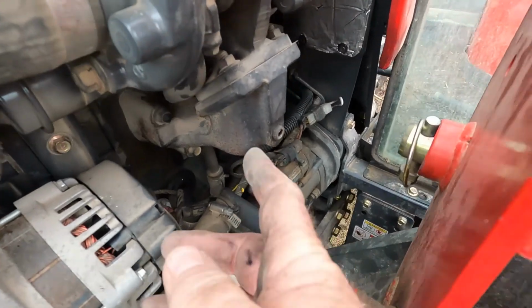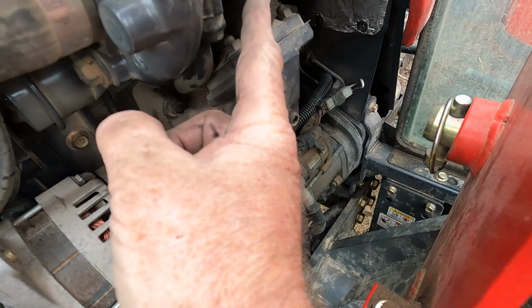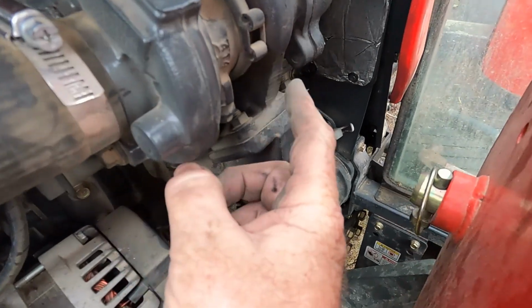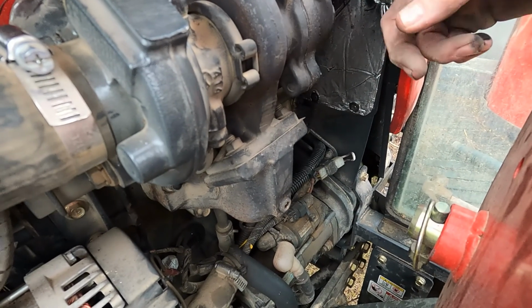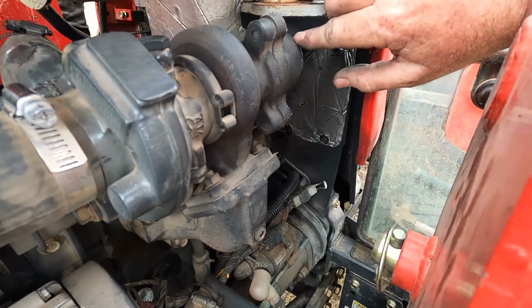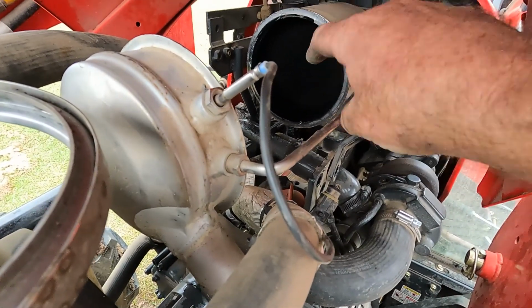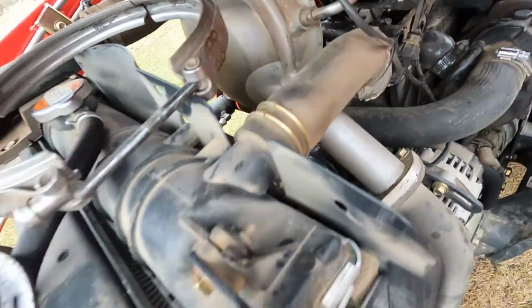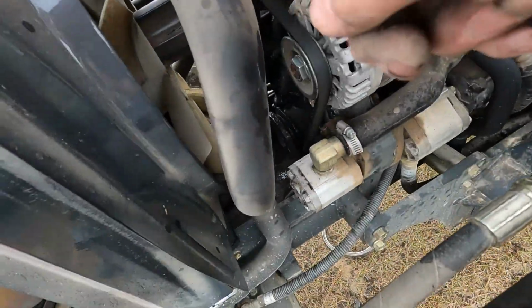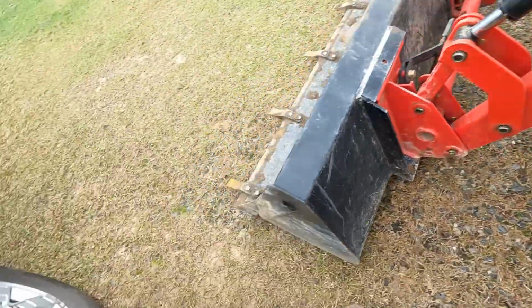And what that does is it comes through here out of the exhaust manifold. It comes up to this turbo. It comes out the exhaust. What isn't recirculated, it comes out the exhaust here. It comes out of this canister here, through that DPF, that filter, into this end right here. Comes down the tailpipe, and actually the tailpipe is the front pipe.